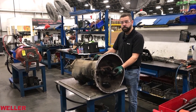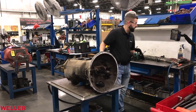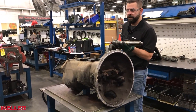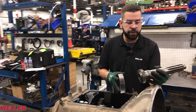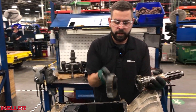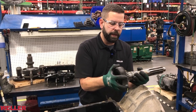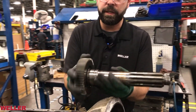The input shaft receives the horsepower and torque from the engine, then transitions to the main drive gear. This is the input shaft — it's splined on both ends. The input shaft splines directly into the drive gear, so any time the engine is running the transmission is turning.